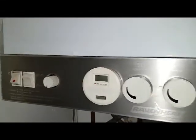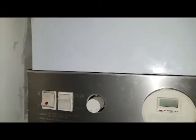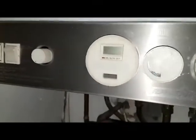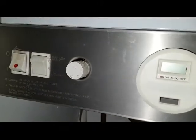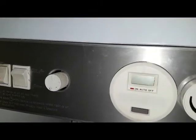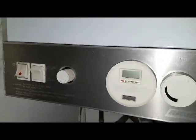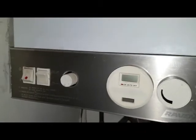So we're going to re-light the pilot light. On this particular boiler there's a little trick to doing the pilot light. What we're going to do is press in that white knob there — press that in. That'll start the ignition sequence for the pilot. Hold it in about 30 seconds and it should stay on.